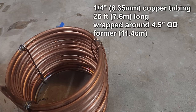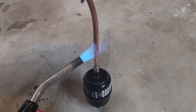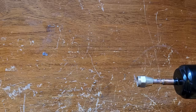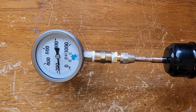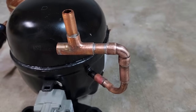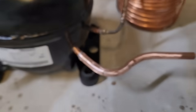Next, I start adding some quarter-inch copper tubing and fittings to the discharge side for the condenser coil and discharge pressure gauge. I made the condenser coil by winding 25 feet of quarter-inch copper tubing around a four-inch PVC pipe as a former, and then added a filter dryer to the outlet. This will filter out any traces of moisture in the system and also remove debris and the horrible smelling odorant that's added to the propane. I added a flare fitting to the outlet of the filter dryer and hooked up a pressure gauge to make sure the compressor was actually building pressure and there weren't any leaks in the system. Next, I started adding fittings to the compressor inlet — the suction port — which used 3/8-inch tubing, presumably since the low-pressure refrigerant would be at a much lower density. Then I added a third line for filling refrigerant, also a 3/8-inch tube.